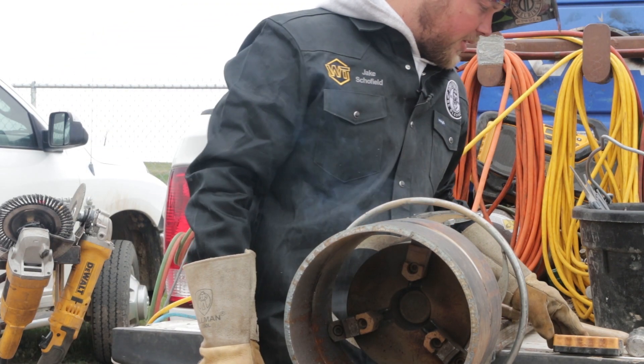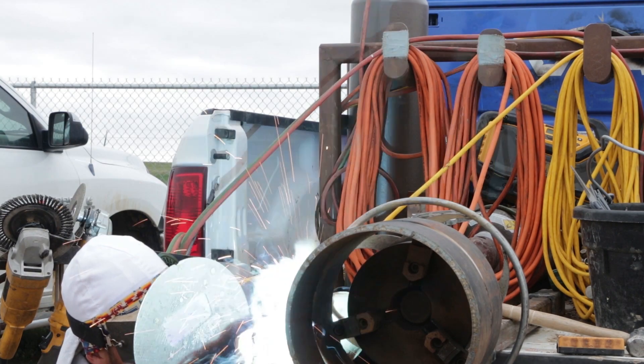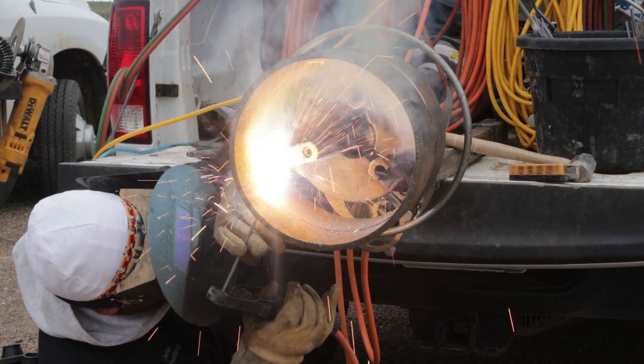It's pretty cold right there — we're going to turn up a little bit and probably grab a new rod so we can finish this all the way out. There's a lot of high-low in this, so you want to really take your time and make sure that puddle is burning off square. You can see the finger now — there we go, now we're cooking. Same concept all the way down.